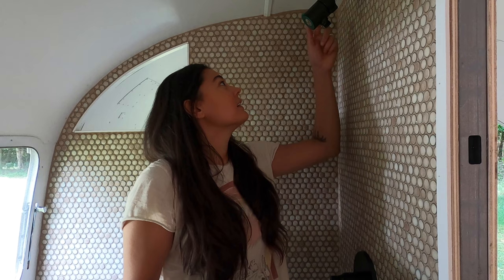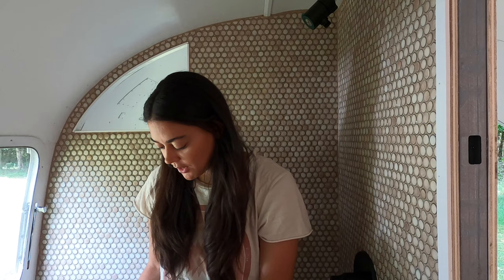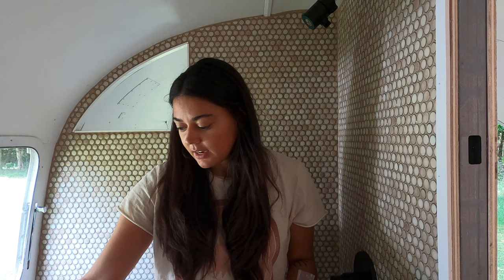So it comes with three washers. One is on the inside of the cradle on this side, and then the shower head gets a washer on this end and a washer on this end. So the next step is to install those washers if yours are not, and then hand tighten hose to shower head cradle and the hand shower.